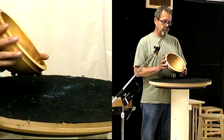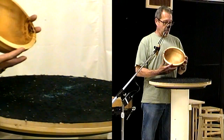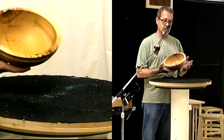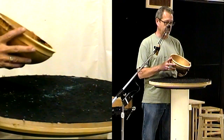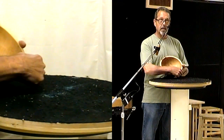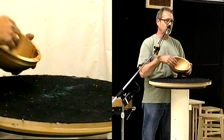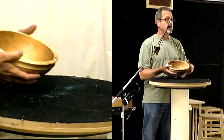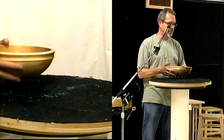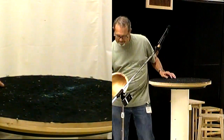So it's really just to show you that a little dark sawdust and some CA glue, you can kind of stabilize it yourself, and you know, a lot of sanding, but it really makes a pretty dramatic effect on the color differences. I would say versus trying to match the color with whatever you're trying to fill that void with, contrasted, to me, it really pops it and actually makes it more of a feature than anything. So that's it.